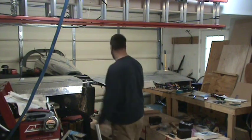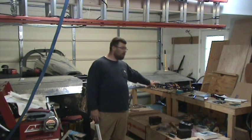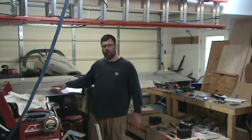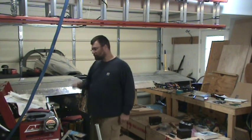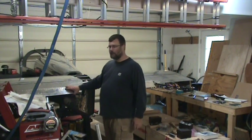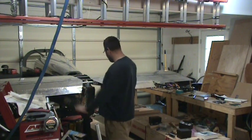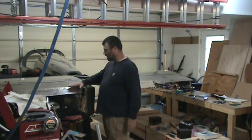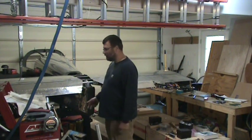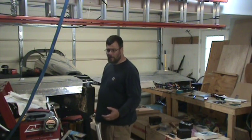Anyway, his method is you get 3 inches there, you run this up level, and then you set this side to trail to match. Because the point where this comes up level, this should have stopped moving. Right now with my current adjustment, this one's adjusted too high. And so as it comes up, this one actually goes above the elevator while this one is still below it. And that's bad. Don't want that. And that's what his method is supposed to eliminate.